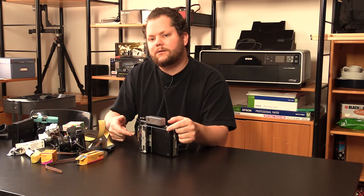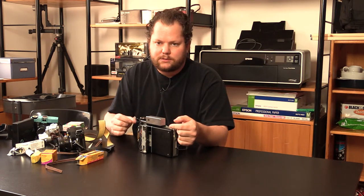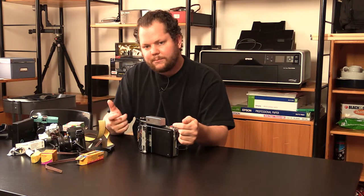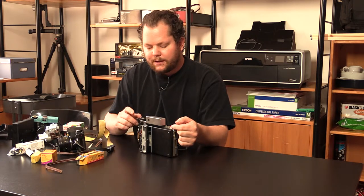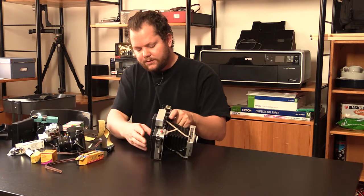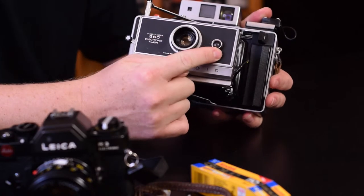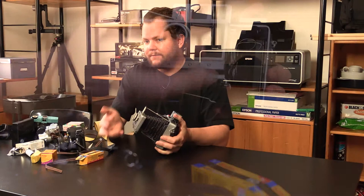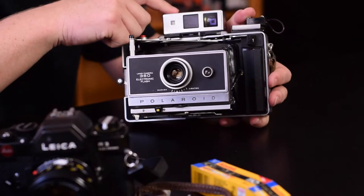Instead of using the circuit that activated when you plugged the flash in, I just rewired everything and made it so there's a switch. When I push the switch, it fools the camera into thinking the flash is on-unit, so when you hold the button down and take a picture the shutter speed increases a little to account for the flash — not too long an exposure. It works very well. It uses a glass lens, has adjustment for lightness and darkness, and has its own sensor — just like a normal 35 millimeter or digital camera — so it does everything automatically. It also has the Zeiss viewfinder.